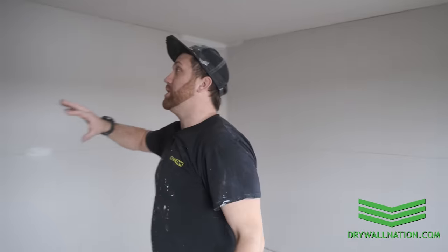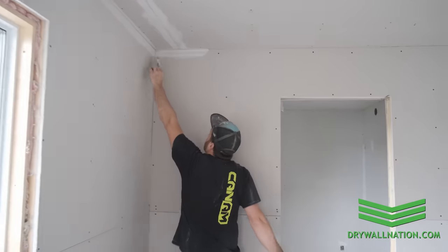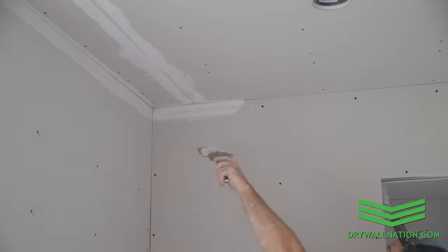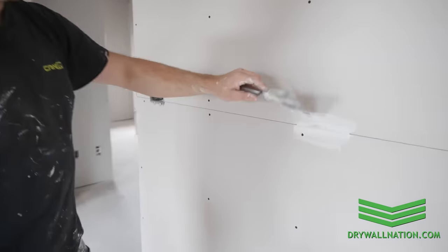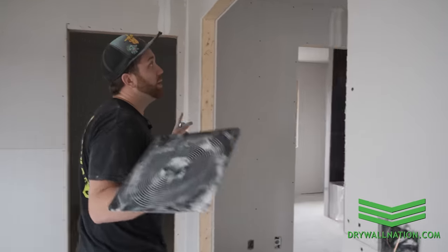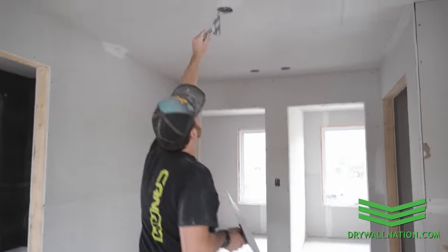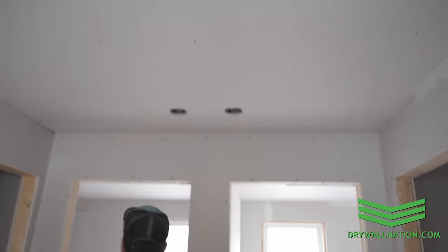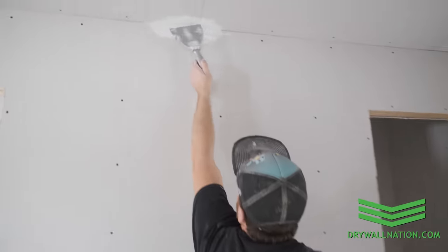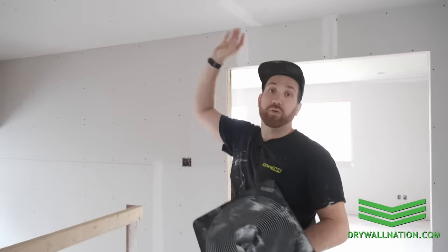This is what our jobs look like before we can start taping. You can see any busted corners, or if the ceiling has a little bit of a bow that gets filled, any cracked corners. Right here this was broken from delivery, so that gets cut out and pre-filled. When we routed out this light we went a little wild, so that gets pre-filled too. Broken corners get cut out and everything gets filled with Durabond 90, which is a setting compound — hot mud. Durabond, Sheetrock Easy Sand, Light Sand — those are all different types of setting compounds, and that's what we pre-fill with before applying our tape so everything dries rock hard and we have a nice solid base.